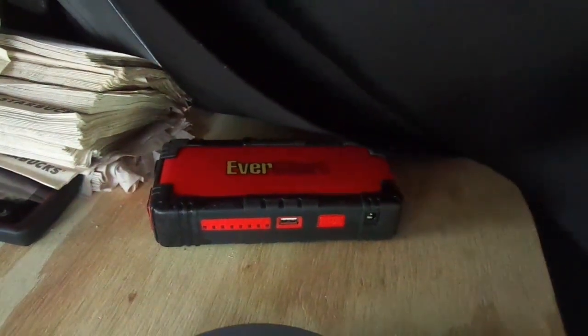That's my system for electricity, and it's exciting that I have good working electricity. This older battery still gives me about one night of fan use, so I can't throw it away — I'll hold on to it and throw it away when it finally dies. Quick update I forgot to mention: if you leave that little unit plugged in, it has a small trickle draw all the time even if you don't have anything plugged in for charging. It'll drain your battery down. I tested this and yes, it drained the battery all the way down by the next morning even though nothing was plugged in.